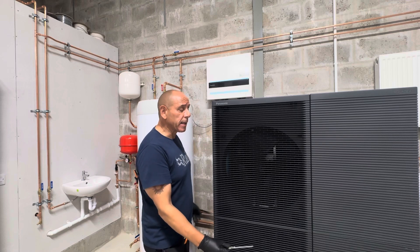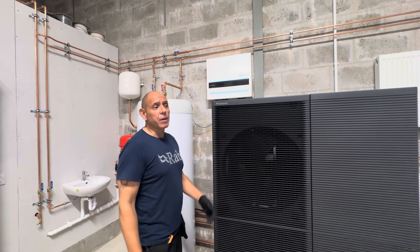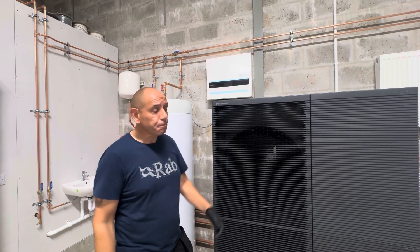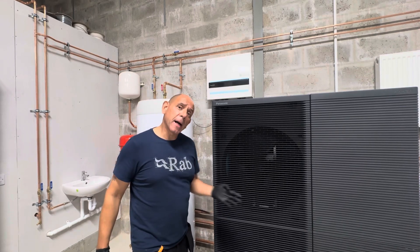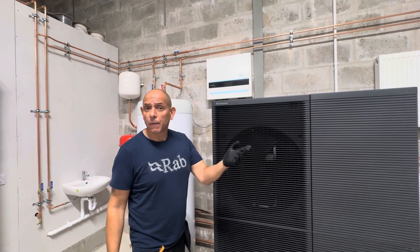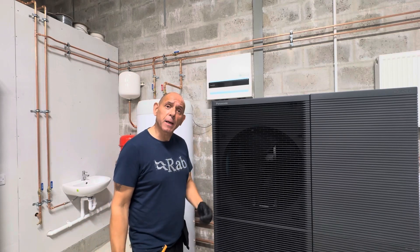We really have got great technology here. It's R290 refrigerant driven — so it's not an R32 unit, it's R290. R290 is a natural refrigerant — propane. It enables us to deliver a higher water outlet temperature, or a higher water flow temperature, for your heating and hot water demands of up to 75 degrees, even when it's as cold as minus 15 outside.